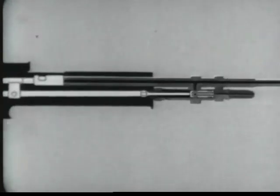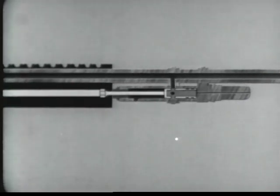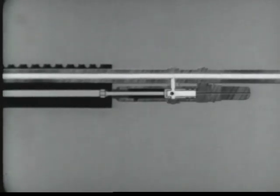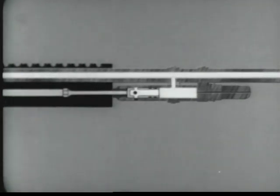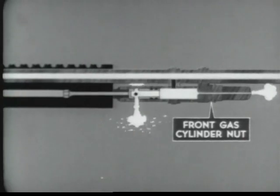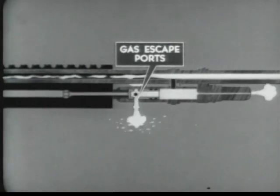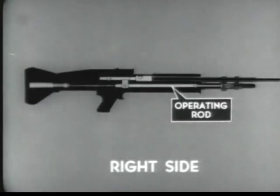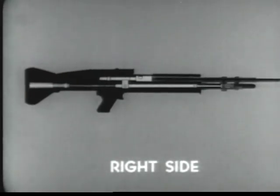The expanding gases propel the bullet through the barrel. When the bullet passes the gas cylinder port, gas moves from the barrel through the gas port into the gas cylinder, entering the piston through the ports in the collecting ring. The gas expands and forces the piston to the rear. The piston strikes the operating rod and begins the rearward movement of the operating parts. The expanding gas moves through the front gas cylinder nut in the gas cylinder extension, with excess gas escaping at the bleeder hole.